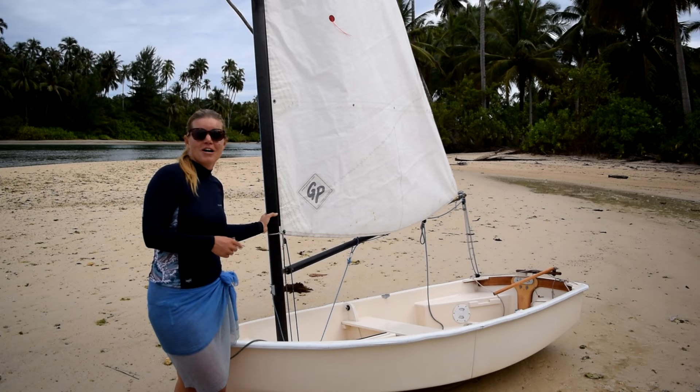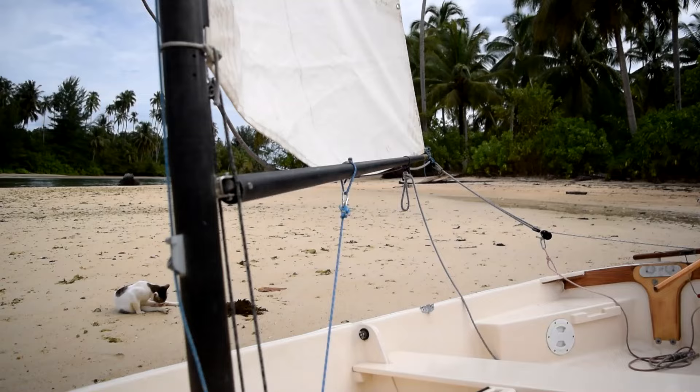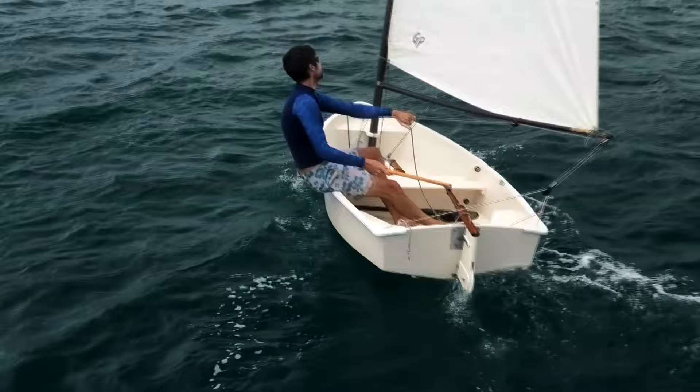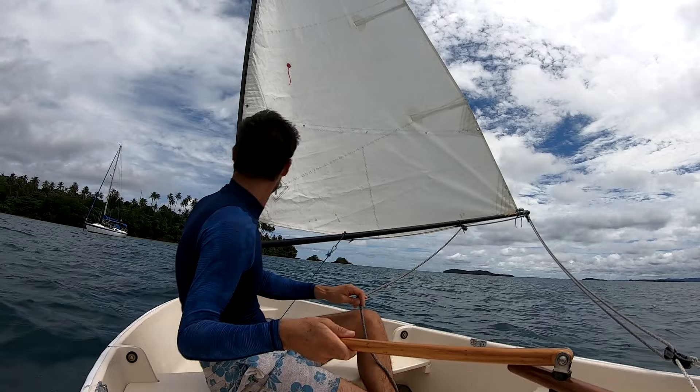The machine is as per the plans, apart from a couple of small alterations to the sailing rig. The plans call for a wooden or aluminium mast, but we've actually got a sporty all-carbon rig — an old broken racing dinghy mast from the garage, along with a windsurfer carbon mast as a boom. We also have a mast track up the back of the mast, which means we can raise and lower the sail on the water, instead of the sleeve luff that the plans state. We have a Dacron sail with one reefing point, which we rarely use, and a simple off-boom sheeting system.